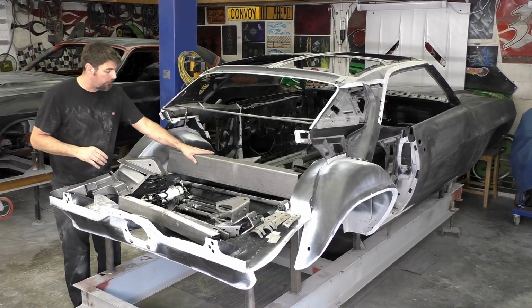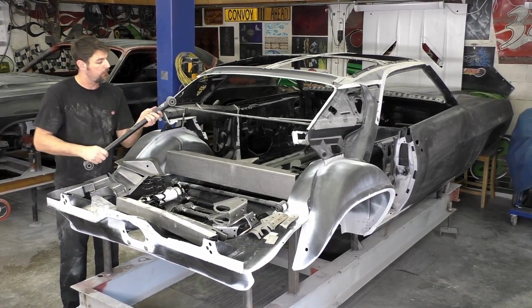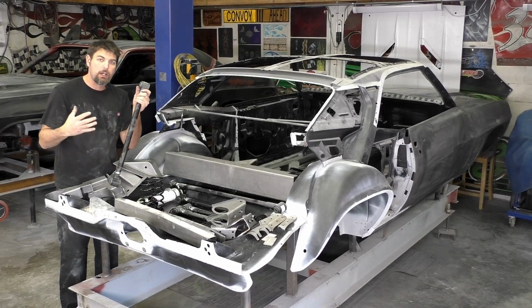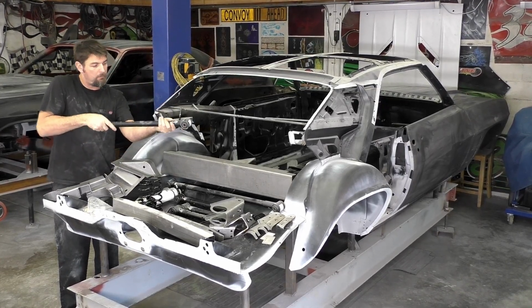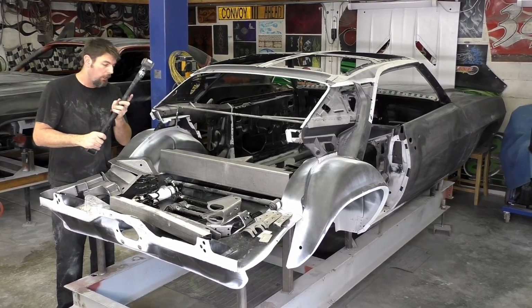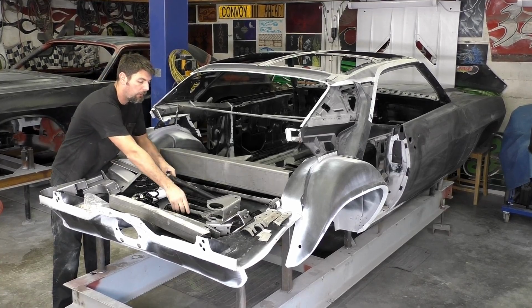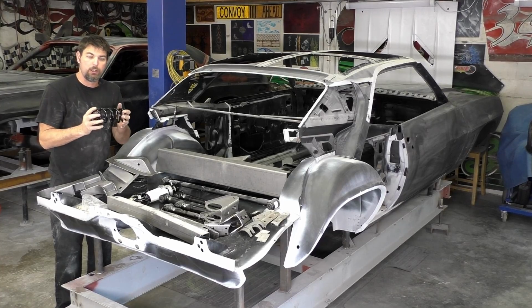We're going to do the Detroit Speed Quadralink kit. It comes with these swivel links. And what I gather, I'm not an expert on these, but I believe these give a little bit of dampening to stop twisting and binding up in the vehicle. So we're gonna put those on there. We got the lower links, we got the upper links. It came with the springs and the coilover kits.